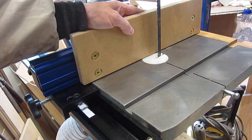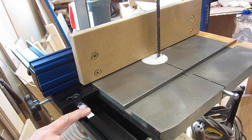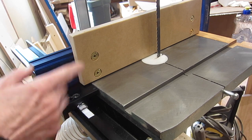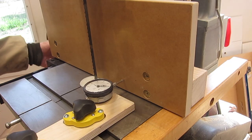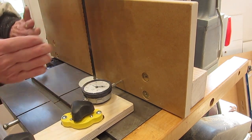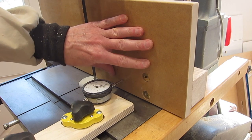I make all the fences out of the same thickness, three-quarter inch MDF. The measurement tape was calibrated and applied with the MDF fence attached, so that it will be correct whenever an MDF fence is used. Even with the knob firmly tightened, if I push against this fence — as would happen when resawing — I can easily get 10, even 15 thou deflection.